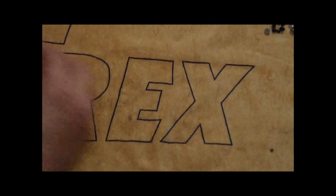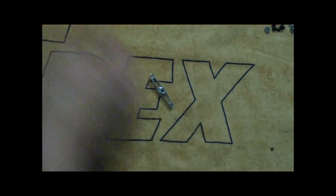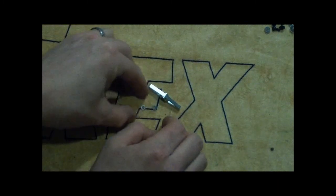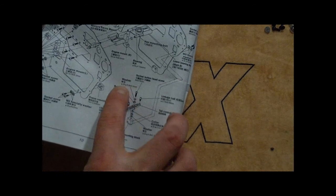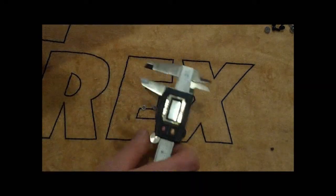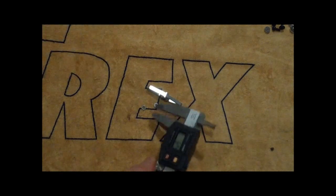Okay, next thing we're going to pull out is this little guy out of the bag set. This thing's completely geometrically identical all the way around, so it doesn't really matter how you do it. Pull out these two washers. You just want to make sure you've got the right washer, so double check. Right down here it says the washer you're trying to go for is 3 by 4.8 by 0.3 millimeters. So take out your calipers, make sure the outer diameter is 4.8 millimeters, and inner diameter is 3 millimeters. These are the two washers that you want to pull out.